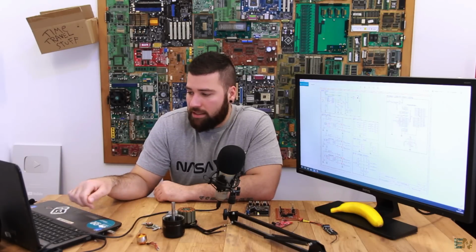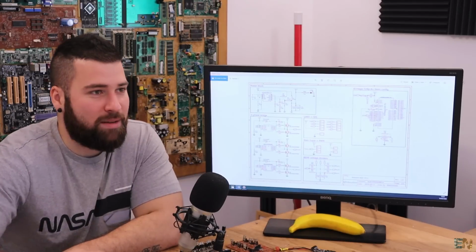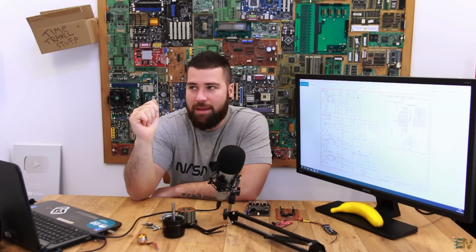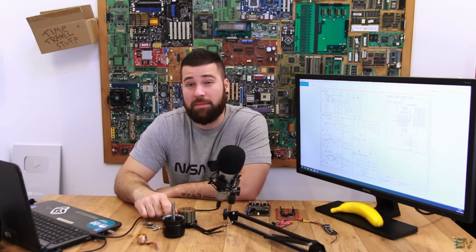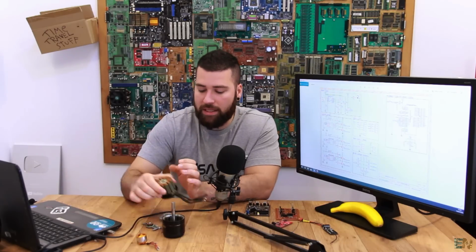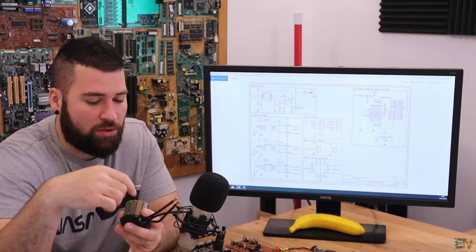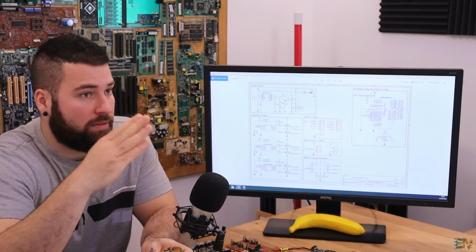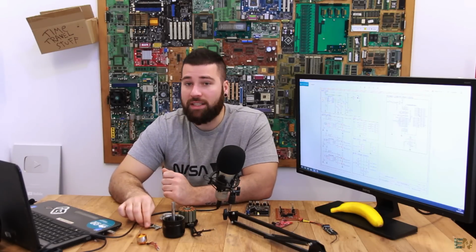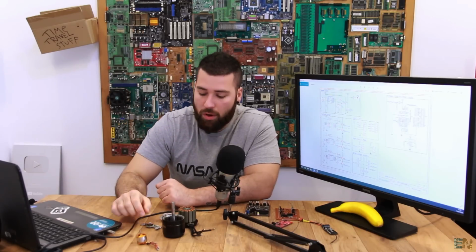So that's it. I think this is where the podcast will end. Well, I already told you that I don't want to call this a podcast anymore, but this episode, this Learn More episode, will end. I'm not sure if I will change the name to that. Once again, I hope that you will learn something new. I hope that this will give you a general idea about how to use the electronic speed controller, because we now know how to control the brushless motor, the internal configuration of the brushless motor, how to apply the signals and control the rotation speed, how to use the triple phase bridge, how to control the triple phase bridge with the microcontroller and the drivers, the back EMF detection, what the zero cross is, how to get that common value, why we make the switch exactly when we pass that zero cross, and so on.